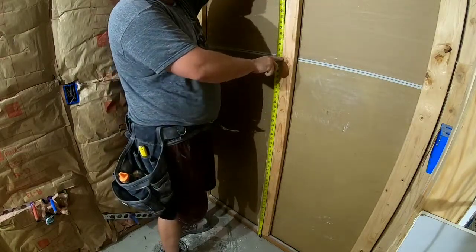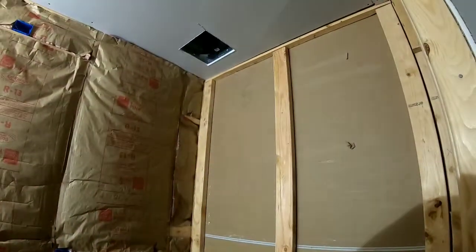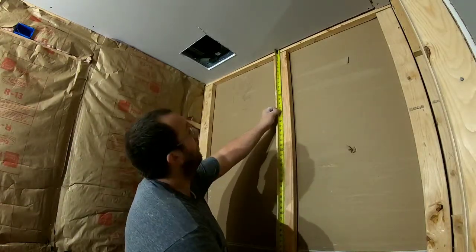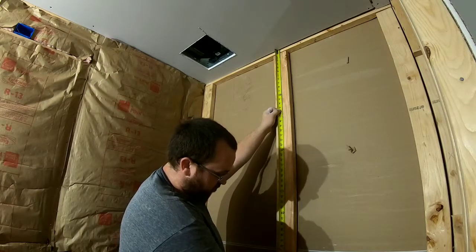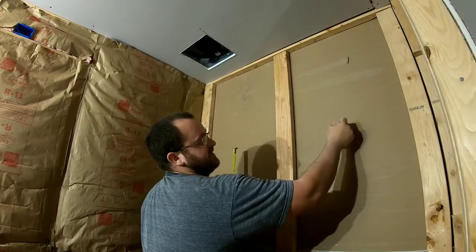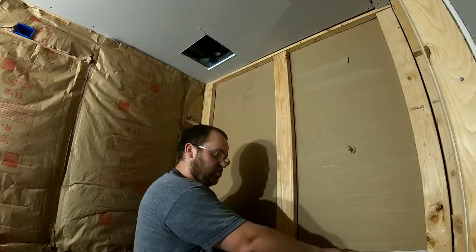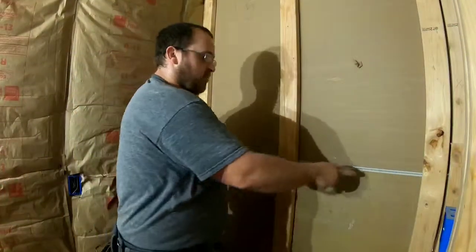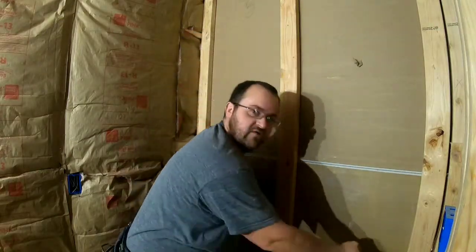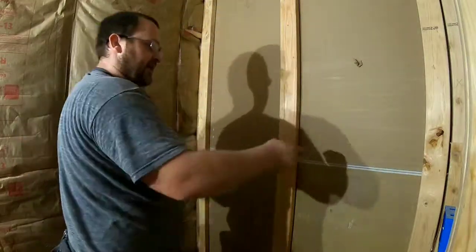There's just a pencil line right there. Then from the ceiling down to that line, I'm at 42 and three quarter — I call it 42-6. That's my rip. When I drywall, I want my joint or seam to be at this height, because if it were down low, bending over is really frustrating. I want it about chest height so when I run my tools it's easier.